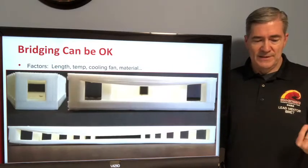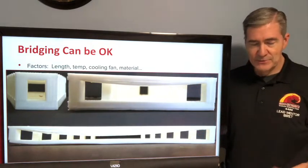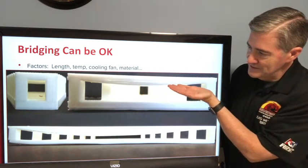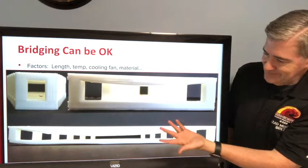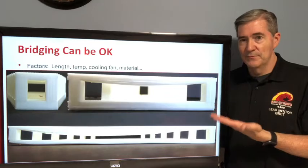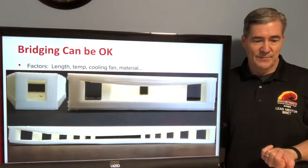However, you can do bridging. If you have an attachment point on the other side, you can bridge across it and it can work okay, especially if you have a well-tuned printer, a part cooling fan, and some other things. For short distances it actually looks pretty good, but for longer distances it starts drooping some. When you get really long it would be very hard to use. Still pretty good for a printer since it is just molten plastic and gravity wants to pull it down — but it's something you have to consider when designing for 3D printing.